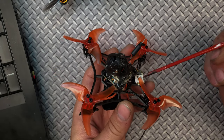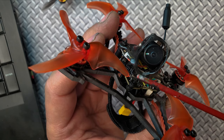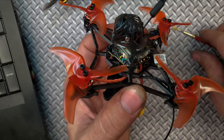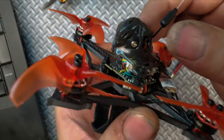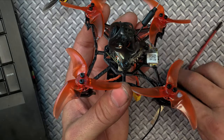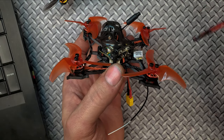There are a couple of things raising an eyebrow here. The biggest glaring one: why didn't they put an extra molding here so it mounts on all four points? It mounts on three different points — why not the fourth one? You have a VTX here and you have the canopy and the camera — can you see that big gap there? What happens if I hit a tree? I also don't like anything that has RX antennas that can get down in the props. Go upside down and bye-bye. This is the radiated end, so if you chop that — good luck.